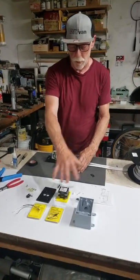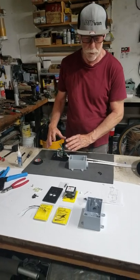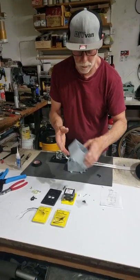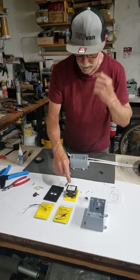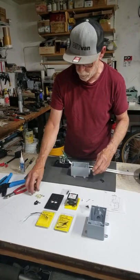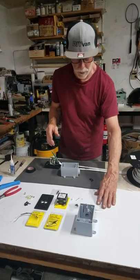Here are all the parts that we use. I've got one that's pretty much almost done that I'll show you more details on. We've got our Cantex box — I don't have the part number on that but it's on our site. I've got my red LED, my green LED, my breaker and the plate that we manufacture, crimp terminals, some screws. Those are all the parts. I've got a diagram, which I like to keep handy when I'm building these up.